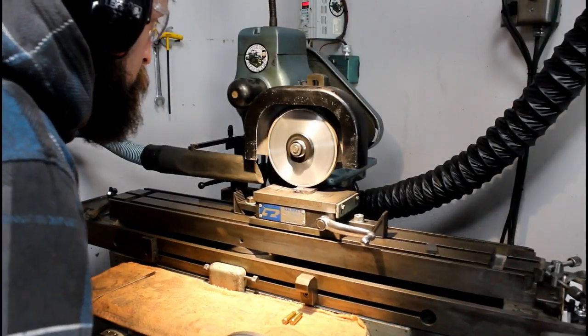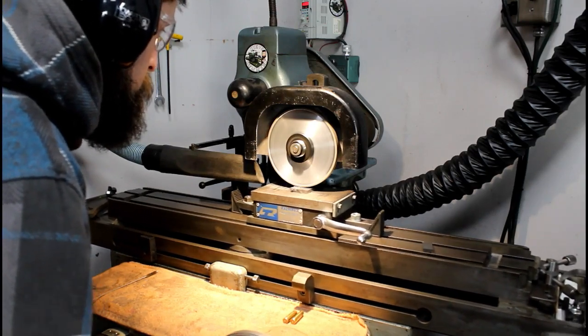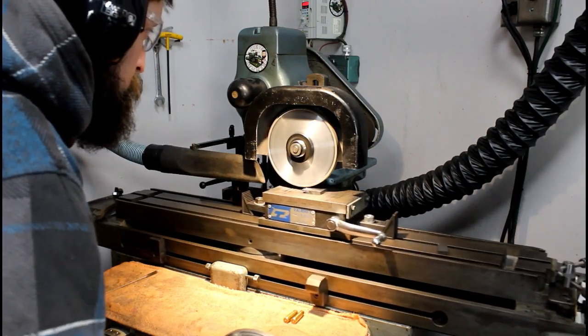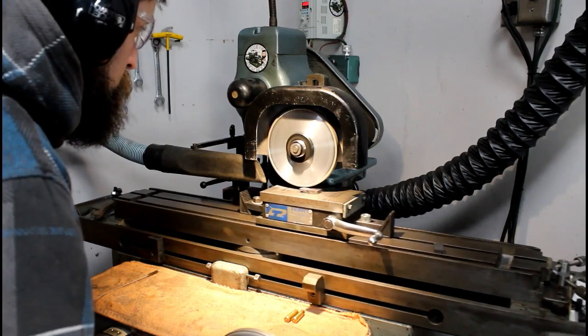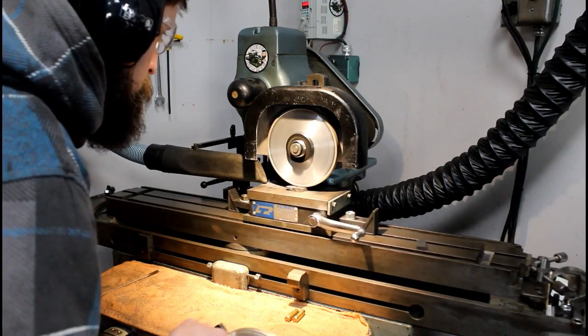So at the moment, all I've got is one wheel hub for my actual surface grinder. So I just decided to throw my little mag chuck that I have up on the cutter grinder and use it to thin these inserts down a bit. The carbide that I brazed on was a little thicker than the original, and I just wanted to get them down to an all even thickness.